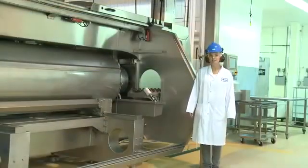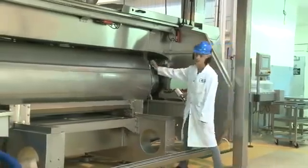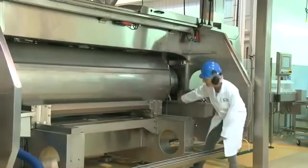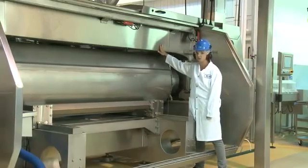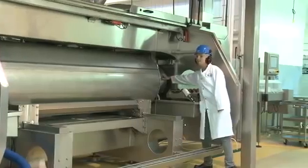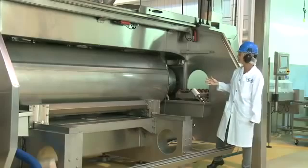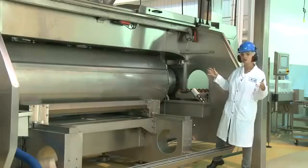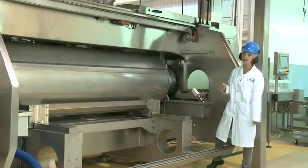Now that the pressure vessel is in place, we'll take a step back and look at the entire piece of equipment. We've got three main components. The first being the pressure vessel which we've seen here. The second being the yoke — this thick piece of metal that surrounds the entire pressure vessel all the way around. It's been constructed so that it can withstand over 4,000 tons of pressure. The third component on either side are the plugs. Those go into place as the vessel is filling with water, and then behind the plugs comes a locking mechanism. The yoke holds those plugs in place so when the pressure increases, it holds the water and allows for the high pressure to be established within the pressure vessel.